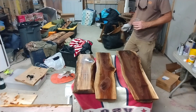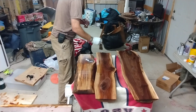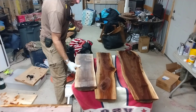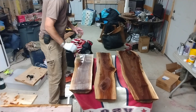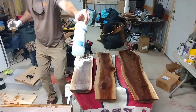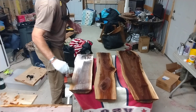These are just absolutely beautiful pieces of wood that would have otherwise been trash. You don't have to use epoxy, but I like using it because it stabilizes some of the softer wood. I take the underside to 120 grit because it doesn't really need any more than that. I do the knots and all the cracks with epoxy — you can get a small tabletop epoxy kit for about $30, and you can get it at Lowe's too. I like to stay consistent so I stick with the ones off Amazon.